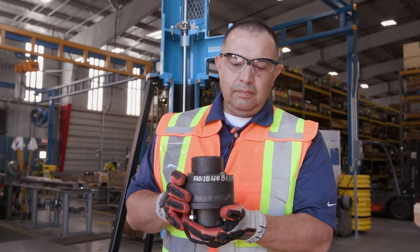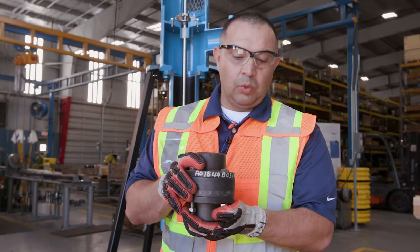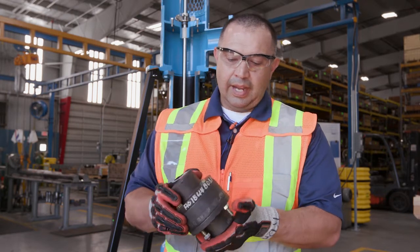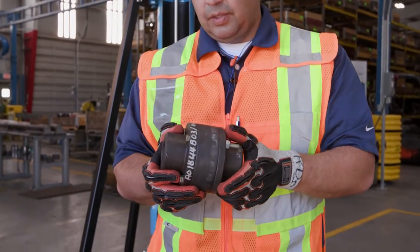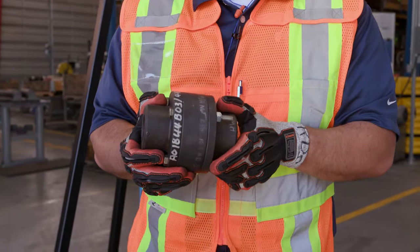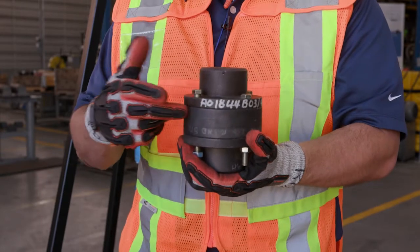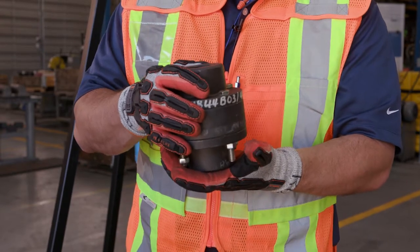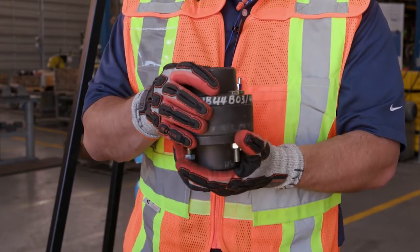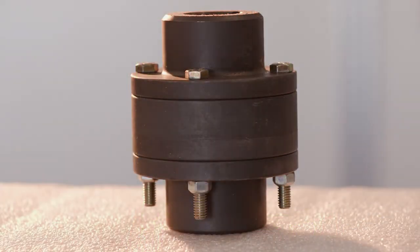This is the A coupling, or adjustable coupling. This coupling is used with any horsepower motor as long as it's a vertical solid shaft motor. It's used with a pack box only, not a mechanical seal. As you'll see on this coupling, there are two hubs and an adjusting plate — similar to the AR coupling but with the addition of that plate. To set the lateral on the impellers using this coupling, you're going to use this adjusting plate. The shafts do not butt, so there's going to be additional detailed setup to eliminate any runout. This coupling can be used with cast heads and fabricated steel discharge heads.